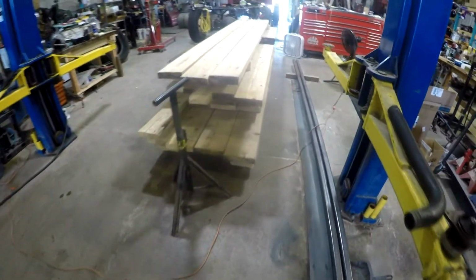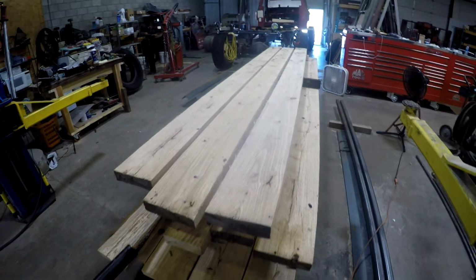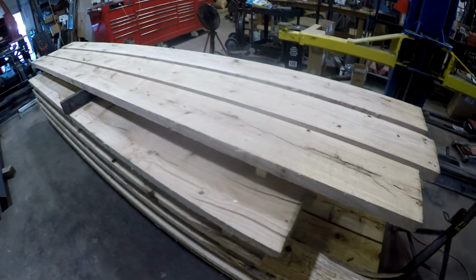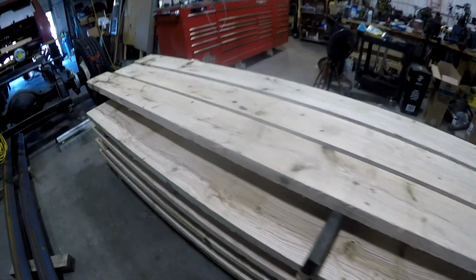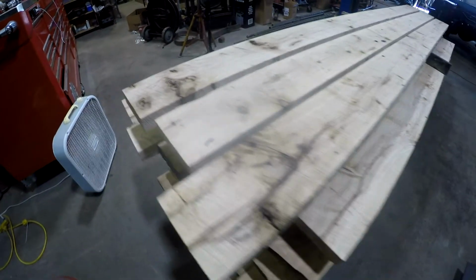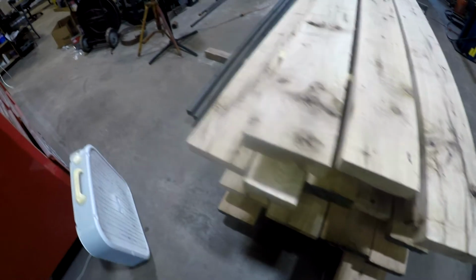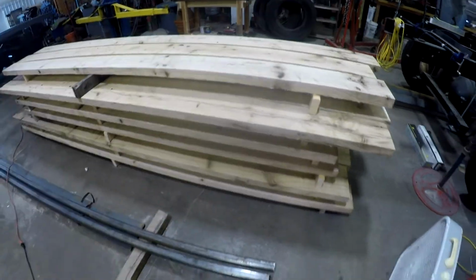The wood is drying out. It's a hell of a lot easier to pick up now than it was originally when I got it. But it is drying out. I threw a tape measure on it, and it looks like it's only shrunk down about 1/16 of an inch widthwise. It looks like the same height-wise. Again, the boards kind of vary from board to board width-wise, so you got to find one that's right. He cut a lot of them 8 inches wide, nominal size. So I try to pick them to measure it off of, for how much shrinkage is going on with it.